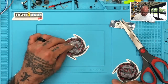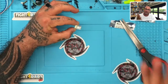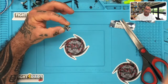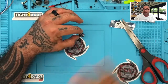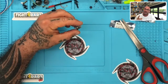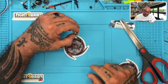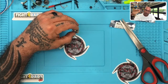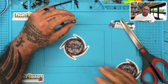This would be good for a lot of you who have asked about running the DJI FPV air unit, which is limited to 4S. If you want to go 6S — or even higher — you wire this in and it will take your 6S and bring it down to 12 volts. Keep in mind the regulator will only kick in as long as you maintain above the target voltage. If you want 12 volts out, you have to give it at least 12 volts in. It's not a step-up, it's a step-down.